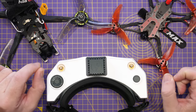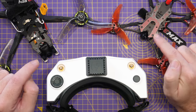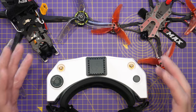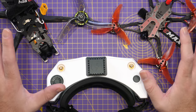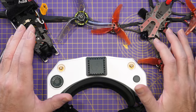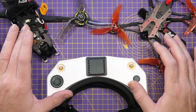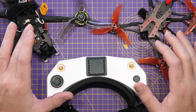However, if you really want to take things a step further, they've developed the new Nano 90 camera that offers a 540p 90 frames a second mode, and with that mode, it offers a system latency of around 14.1 milliseconds. That again can be dramatically lower than any other digital FPV system on the market, but may even be lower than many analog systems on the market. There is no digital FPV system out there today that offers fixed latency, but also latency as low as HDZero. And in some ways, you will find HDZero may even be lower than the analog setup that you're already using.